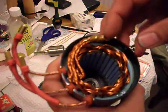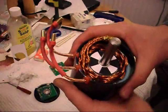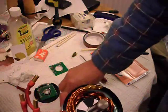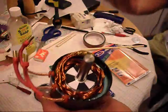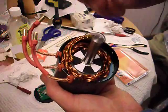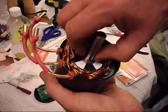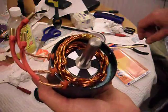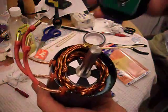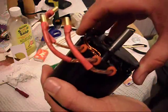After getting all the bits ready, we've carefully inserted the rotor. Next we have to put the spring washers and shims back, just as they came out. On this motor they were all four inserted in the back, so I'll just pop them back on — they sit on the spacer exactly where they were before. Then after we've wired it up, we just replace the back.